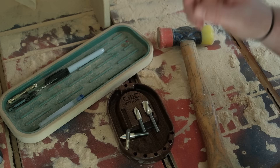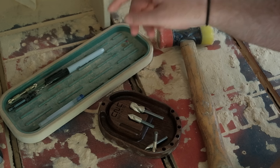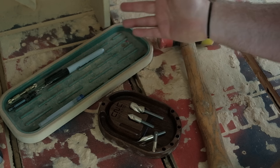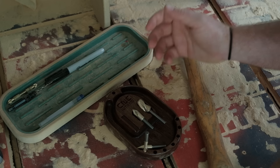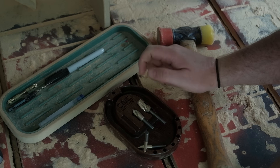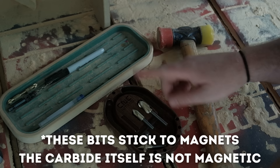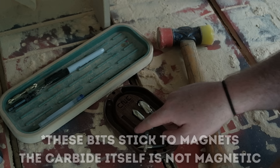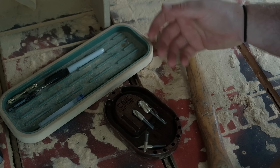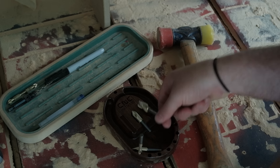At the end of the day I thought the simplicity of using the bowl bit to carve out the V-bit area and having it stand a little proud was worth it. Feel free to change things around to suit yourself. This is just version one of the HD beginner bits holder, and it's a fun one to play around with. Eventually I'd like to have a magnetic version on the wall — the carbide is magnetic — but I played around with placing magnets and found it was distracting, especially since it could lift the entire tray as you try to grab a bit.